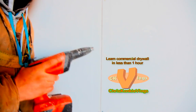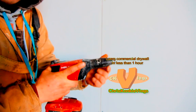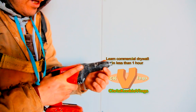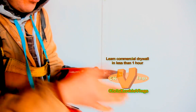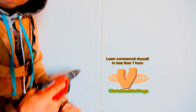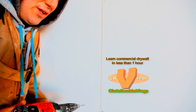It's important that you have your depth set properly. All drywall guns come with the depth sensor, or the depth gate, like this depth nozzle. You turn it in or out. They all have a diagram, right? So this one here, you turn it inwards, it goes in. You turn it out, it goes out. Makes sense, right? You don't want to break the paper of the drywall. You just want to countersink it, just so that the mud will clearly go over it. And you don't want the screws to be hitting the trowels.